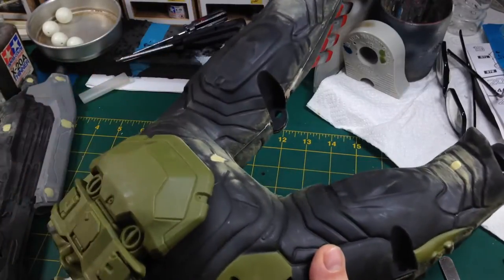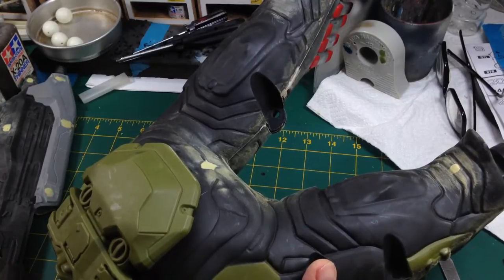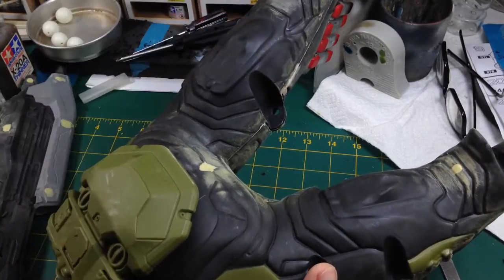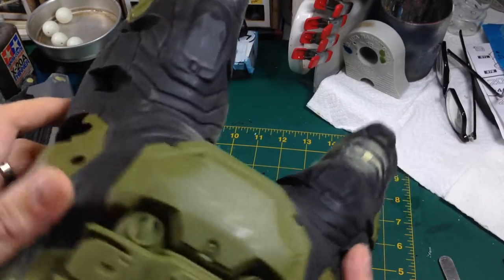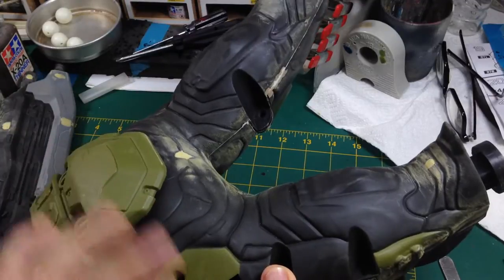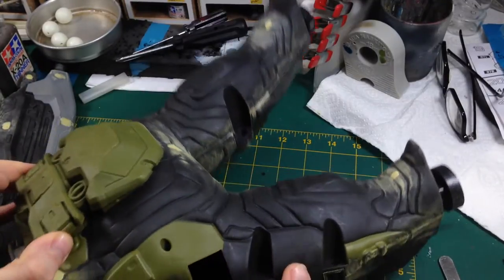They look nice and flush, but the true test will be when we get the primer coat on it. If anything's sticking up or obvious, or any edges that I need to deal with, they'll become apparent under the primer. It can look great now under the light, but once you get it in one solid colour like white or black, it will stand out like a sore thumb if it needs further sanding. So we'll get it primed.